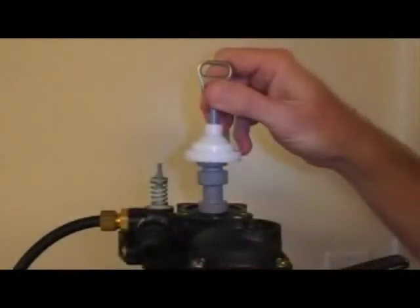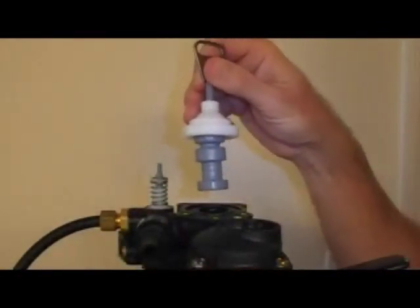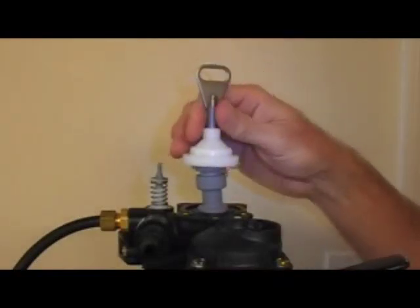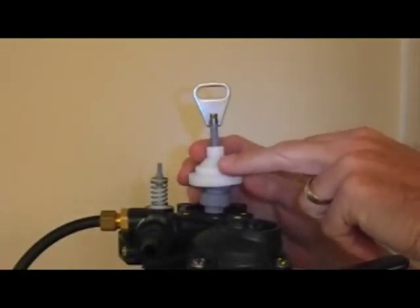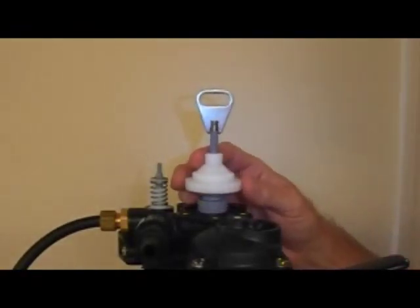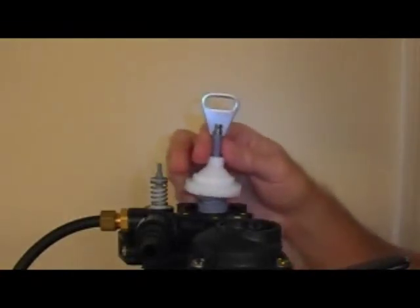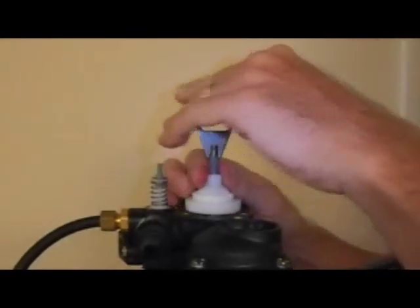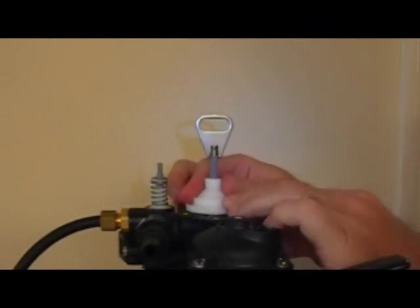Got a new piston. This is a softener piston — you can tell by the white top. Some older pistons used green Teflon; this is gray Teflon, but that doesn't matter. Softeners are white top. Backwash-only units and green sand and a few other filters might be black top. They also make a gray top, used sometimes on city water low-water applications. Any of them would work — they just have different backwash times based on that.